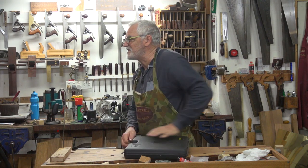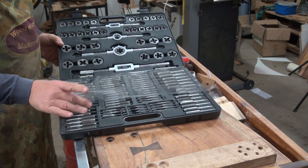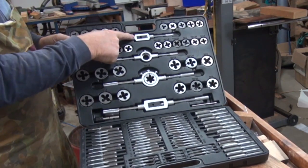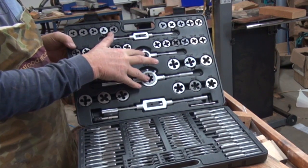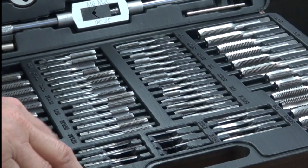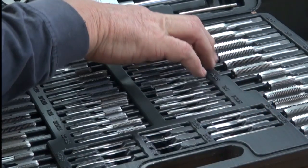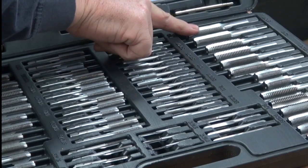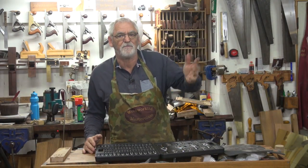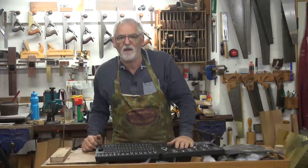What you get inside is fairly impressive. These are all tungsten bits — 110 pieces. There are two tap wrenches and two die wrenches for different size dies. On the taps, it goes from 2mm 0.4 thread up to 18mm 1.5mm thread. All of those taps come in two sizes: you've got your taper tap and what I call a secondary tap — some people call it a plug tap. But it's not a bottoming tap. A bottoming tap is cut off square and it'll go right down to the bottom of what you're tapping.